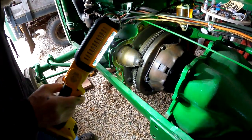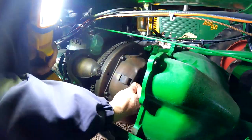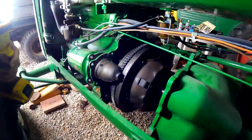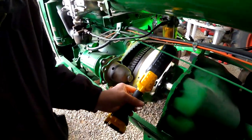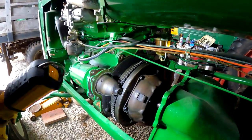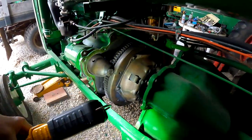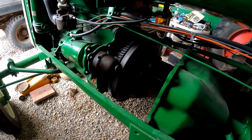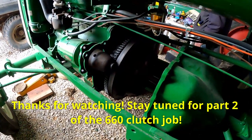So what do you think about that? Thinking there's plenty of grease there. These are the ones that I was wondering if they were finger tight. These just mounted to the flywheel. Put the light right here so we can look at that. I would say nothing was done on the clutch here. As far as restoring goes. Right. Painted on the outside. See these cracks? I don't like them. It's also greasy on the flywheel. Look at all that. I wouldn't even bother trying to do anything with it, putting it back together. I think we're at the point now where new and then she'll work, huh? Yep.